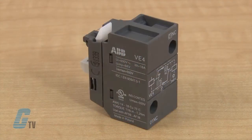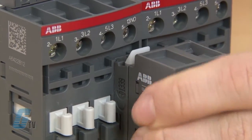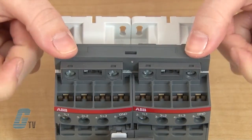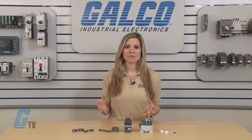For an additional electrical interlock, I will have the VEM4 kit which includes a VE4 device that mounts on the front of both contactors by sliding over the middle of both interlocked contactors. Then I will connect the coiled terminal block. I will use the A2, A2 connection here, which will make both of these contacts my A2 connection and my front mounted device will be my A1 connection.